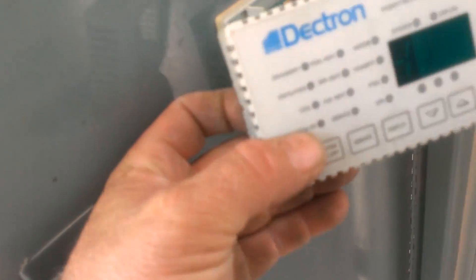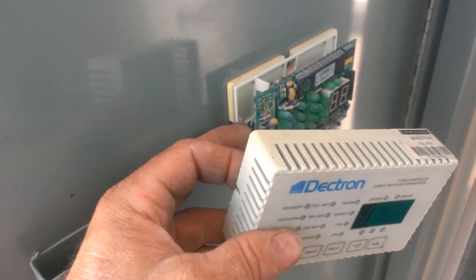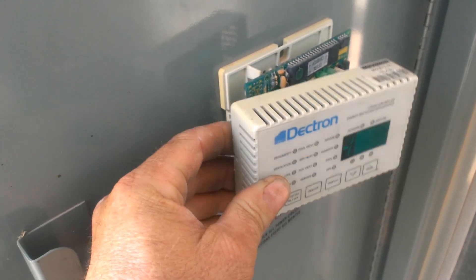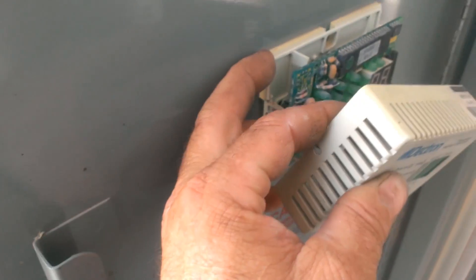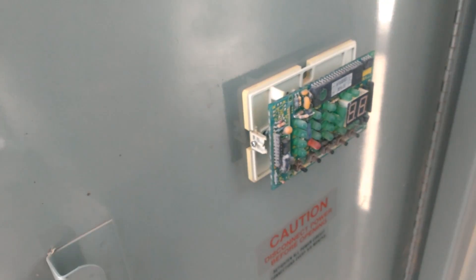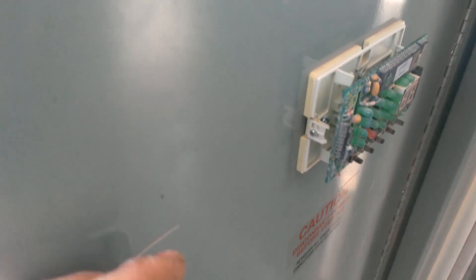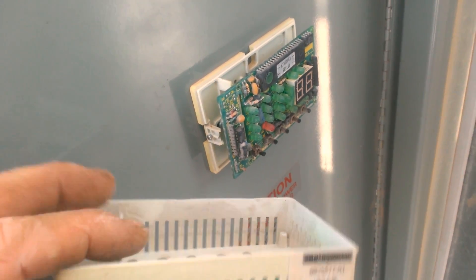Here's the controller that seems to be bad. I took it apart — this circuit board goes in here and then this snaps on here. The way they set these up is you can mount the thermostat right on the unit, which I'm up on a roof right now. Normally this comes off and there's another sub base that goes on the inside — bolted on there in the pool room. It doesn't have any sensors on it; the sensor's just in the return. These run blowers all the time — it's how they're designed.